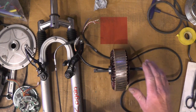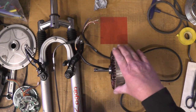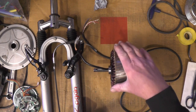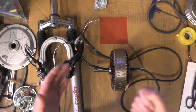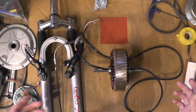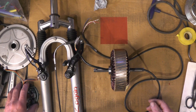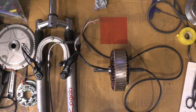This procedure is a bit risky if you're not careful, because when this rotor approaches the hub, the magnets pull it in and you've no second chance of moving your fingers. So keep your fingers out of the way. I've got no proper equipment to put it in, so it's just going to be suck it and see.